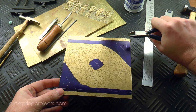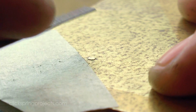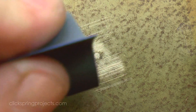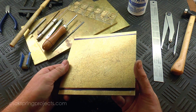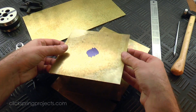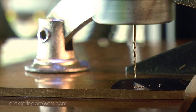The excess pin length on the other side was then trimmed off, filed back, and blended in with the surrounding metal. The registering process was then continued for the remaining plates in the stack, progressively moving from the top down, registering each plate with the one beneath it. Again taking care to align the plates carefully before drilling, and placing the pins in regions of the mechanism known to be available space.